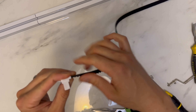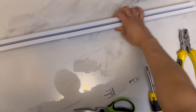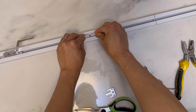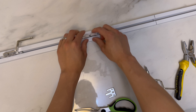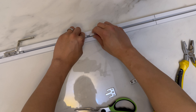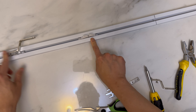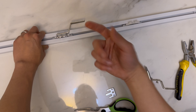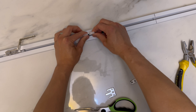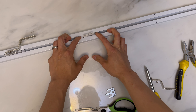Rejoin the system and check that the carriers are now closer together. If they're almost completing a loop, you're good to go. If it's still too tight and you feel like you're forcing them together, repeat the same process on the other carrier — release one more tooth off the belt. At the perfect tension, you shouldn't have to force anything; everything should just line up.